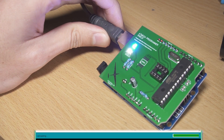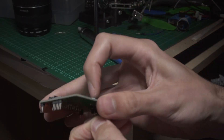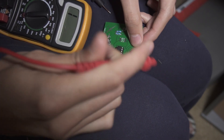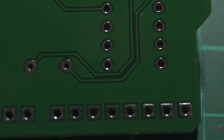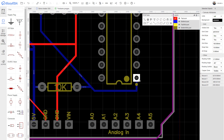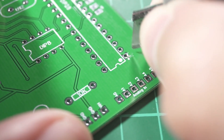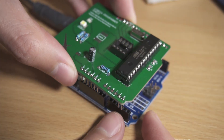If you don't use 'Upload Using Programmer,' you'll program the Arduino being used as the programmer instead. I hit upload and it completed, but the LED wasn't blinking, so there was a problem with the PCB. After troubleshooting, I found that pin 10 was connected to ground. Looking at the design, I realized I had mistakenly connected the reset pin of the ATmega328P to ground. I had to make a manual correction on all five PCBs, and after that everything works fine.